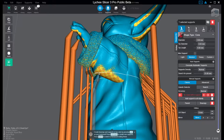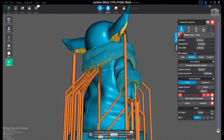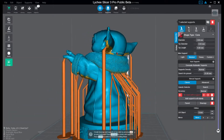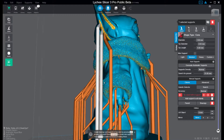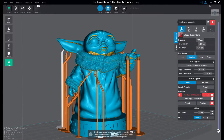And then I am going to add support where you see this white line — where it gets thicker and wider. It's always good to add the support there because that's a low-hanging part, so to say. If you take a look at this ear, it has this as well, so I'm going to add one there. You can only add supports to the yellow and orange checkered areas because they are facing down toward the build plate.